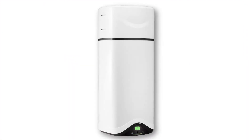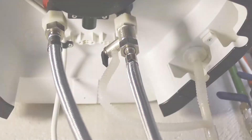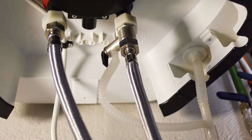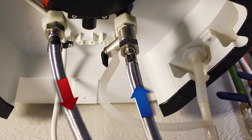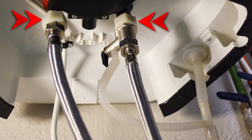The newest heat pump has the same function as an electric boiler but with consumption savings of up to 75%. The hydraulic system is practically the same as that of a boiler of the same capacity: cold water inlet and hot water outlet. A safety valve must be installed on the cold water inlet and a dielectric sleeve on both hot and cold inlets.